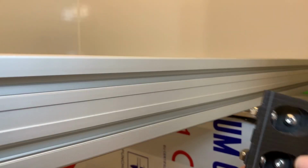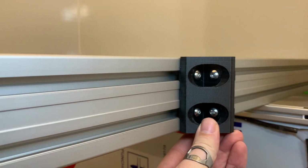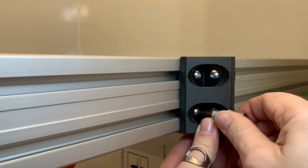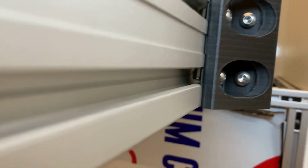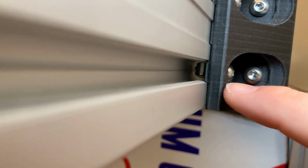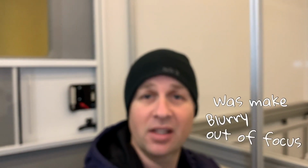Well, that's interesting. Maybe back up and erase the last couple scenes here. I just made a bit of a discovery. When I took the corner bracket and I installed it like this and then tightened the nut, everything seemed fine. But in reality, I had the nut screwed on too far. So when I inserted it into the track, the nut has turned and twisted sideways in the outer portion of the track, but it hasn't actually rotated far enough to catch the back. So effectively all I did was make jam nuts in slots that when I pulled on it, it actually just pulled back out again.